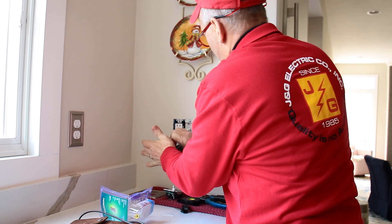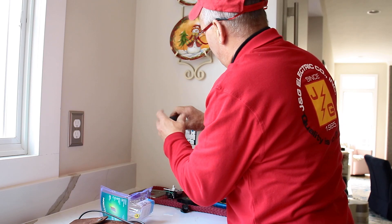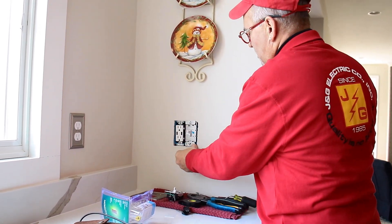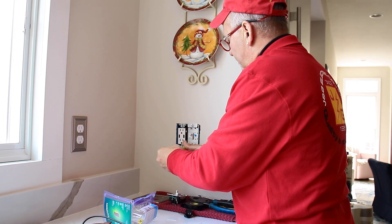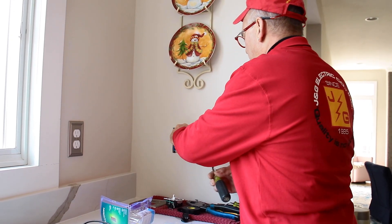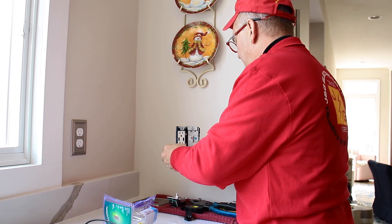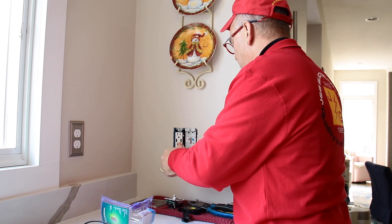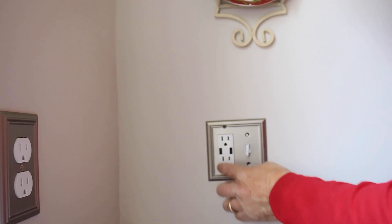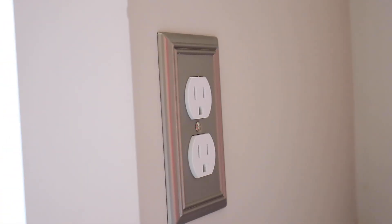You may be looking at the outlet that's next to this dimmer — it looks a little different than outlets you've seen. This is an outlet that has USB charger points, so you don't have to have your charger transformer plugged in — it's a neater application. They replace existing outlets in your kitchen or living room, wherever it may be. The square-style device is called Decora, while this outlet is a standard duplex.